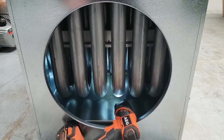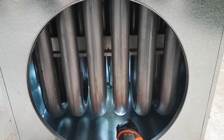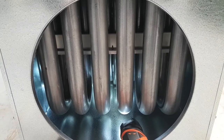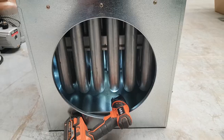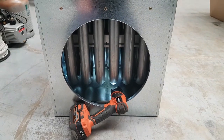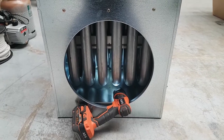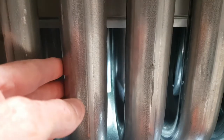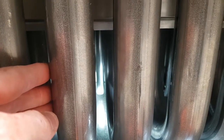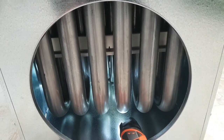This is the heat exchanger. That room circulating fan draws the air in through your return air filter and ductwork, then pushes the air over the outside of these tubes of the heat exchanger. That's connected to your supply air ductwork, through your zone motors and ductwork, and that's the warm air that comes out of your ceiling outlets. On the inside of these tubes is the air and gas mixture which has been ignited and heated — that's your poisonous gas, and it's always kept separate from your room circulating air.